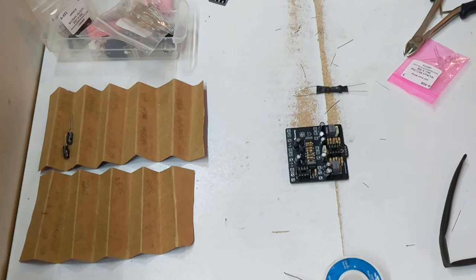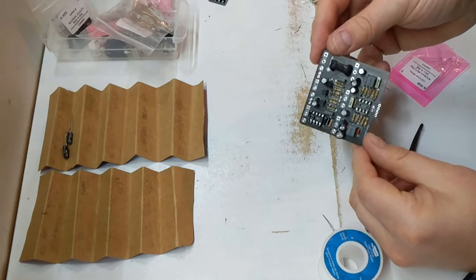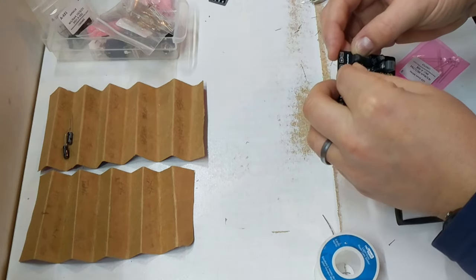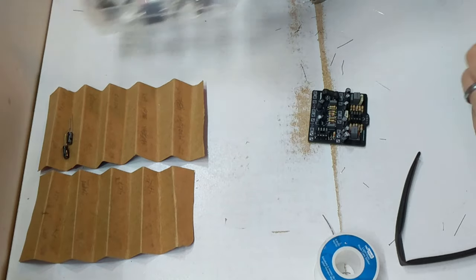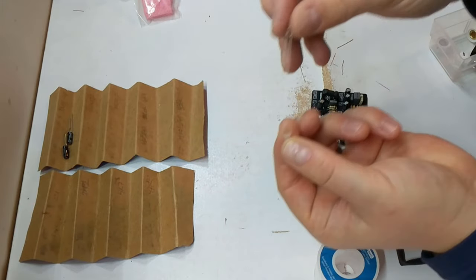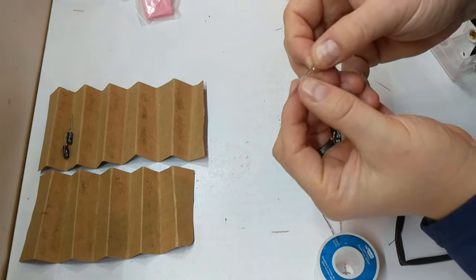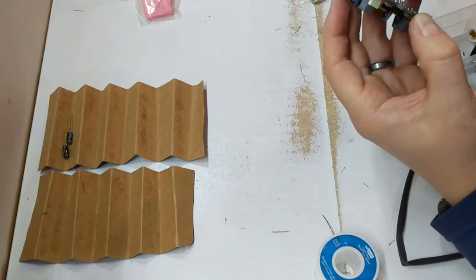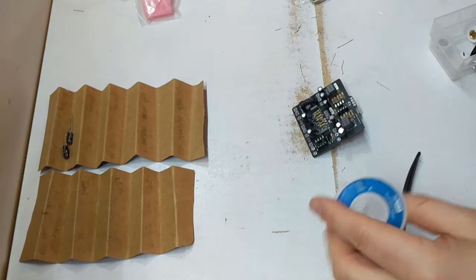Now what we need to do is seat that in there correctly. We have our LED and LDR in there. Next thing is we can either do the on/off diode or we can do the transistors — I think we'll go with the on/off diode. I have just these little spacers for the legs, and you just feed your LED down in there, push that up tight. This is actually going to go on the opposite side, so I'm just going to tack one side in right now to keep it there. I'm going to bend this out of the way for now.